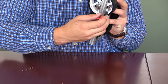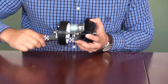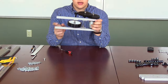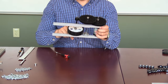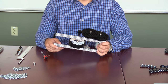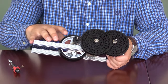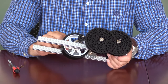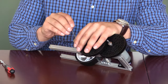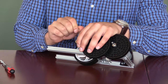Sometimes we will have to move between the parts of the wheel in order to tighten everything down. Again, we can test our final system by making sure that everything spins freely — either by spinning the wheel or by carefully spinning the middle gear. If the system were locked up, we would take this final assembly apart and try to reattach more cleanly. Then we will tighten down the final shaft collar, making sure that the assembly is secure.